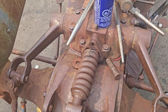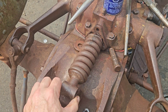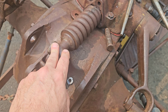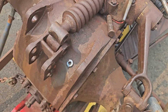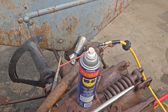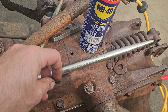It's the next day, boys and girls, and this thing is kicking our ass. We really think the problem is right here — the draft control. There's play in here, and you can hear that — it's affecting the internal linkage. I can't set this up until we get the replacement parts. There was a felt washer and a cast iron cup in here; I took it all apart and the cup is broken too. Because that's out, it's allowing more play.